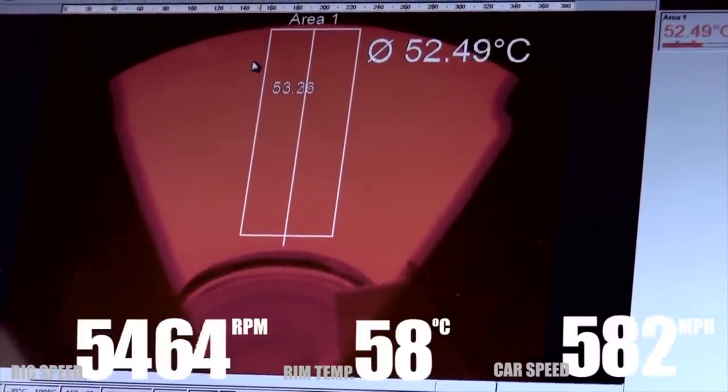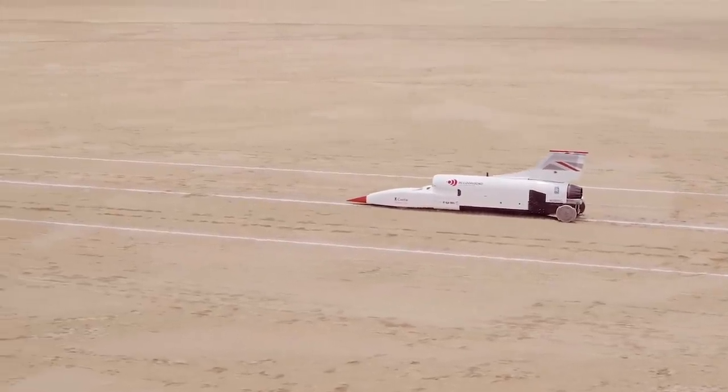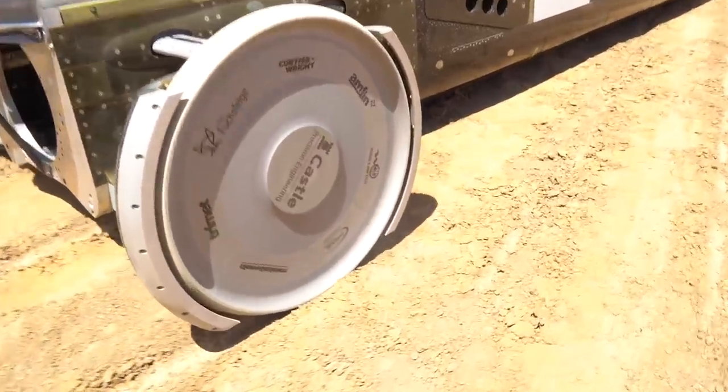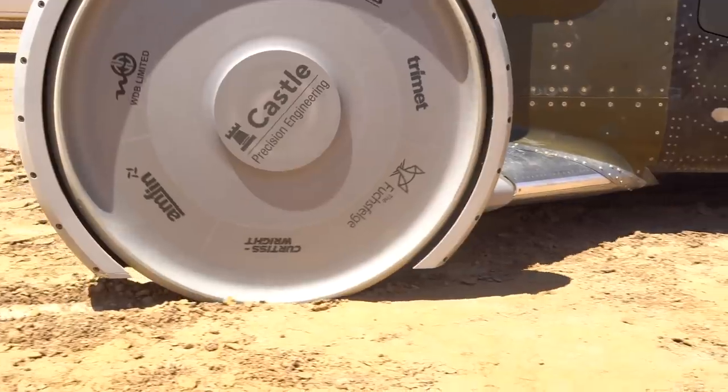If you go back to what we're trying to do, we're not driving the car through the wheels. So actually we don't need very good grip between the wheels and the desert. For us, just a solid metal wheel. And the tyre bit, the compliance, the squidginess, is actually from the ground. That's where our tyre comes from. It's from deflecting the ground as the wheel runs over it.